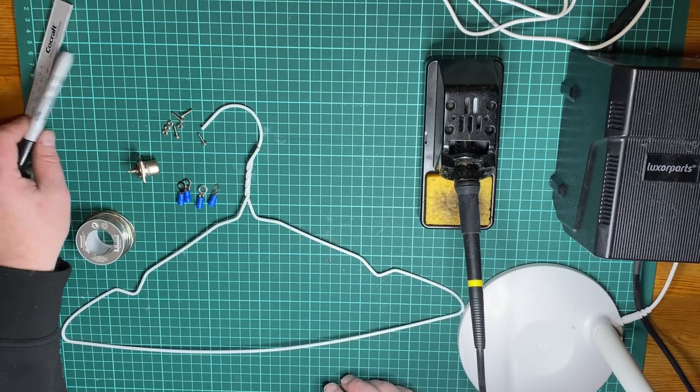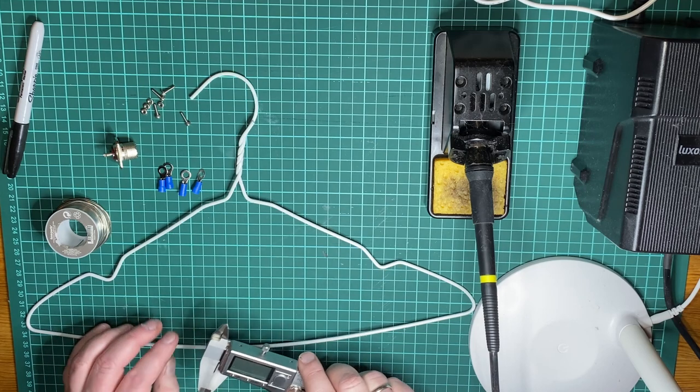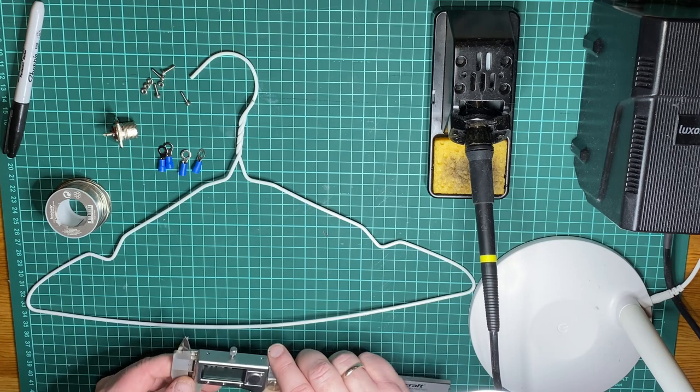So let's get started. As we saw in the introduction, we're gonna need one element, which is 6.5 centimeters, and four radials, which are 7.3 centimeters. And this is a receive-only antenna, so you just gotta be in the ballpark. We're not gonna put this in an analyzer and see where the resonant point is. The point here is to build something easy, which will get you in the ballpark. So let's start here.